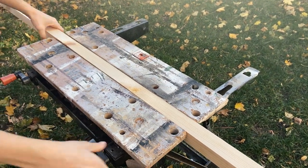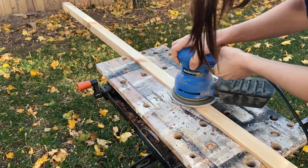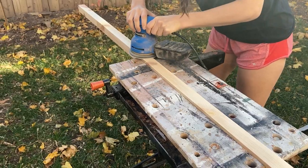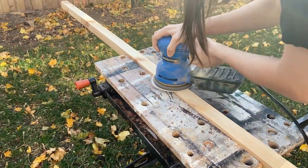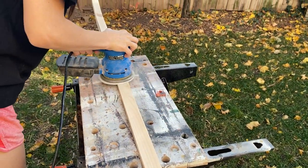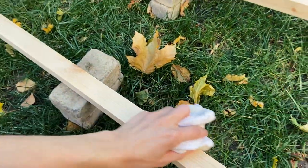First things first, you're going to want to sand down the sides of your lumber and make sure they are all nice and smooth so the stain takes nicely. I started with 80 grit, nice and rough. Since I'm using knotty pine it's quite rough on some of the knotty areas, so spending a bit of extra time and care there is important — especially since I want the knots to really shine through in the stain. Because I bought these during corona times and everyone was doing DIY stuff, Home Depot was pretty low on stock, so if your hardware store has more selection I'd suggest picking nice smooth pieces to make sanding a lot easier. Do this on all four sides of all four pieces, upping the grit as you go — 80, then 120, then 220. Once you've sanded all your pieces, wipe each side down with a wet cloth to get rid of the dust so the stain will take nicely.